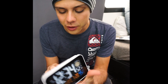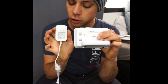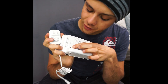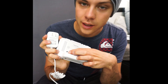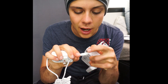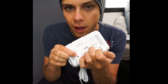This thing is really nice. I only bought it at Goodwill for $12 and it's really high quality — brand new. Alright, we have two important things to look at. Where you plug it in, it says 5 volts and tells you the polarity of the plug. It says the outside prong is negative and the inside prong is positive, so the outside piece of metal is negative and the inside is positive. You need to check right here to make sure it has that — not all of them do.